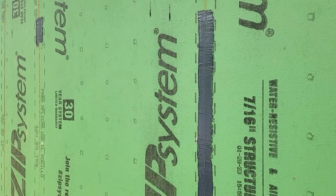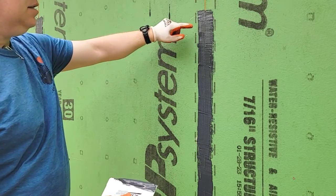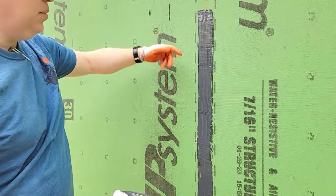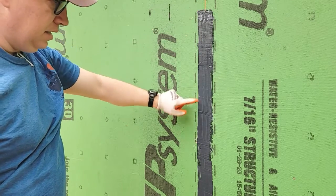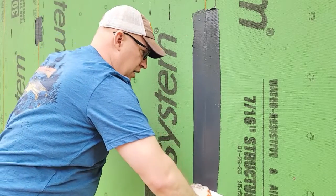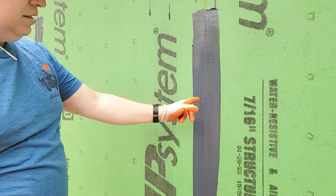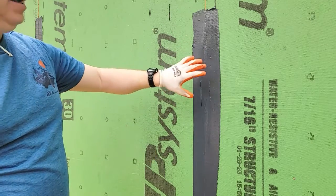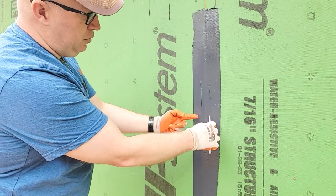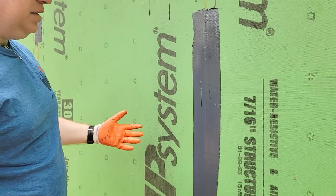One of our crew members used this applicator and said it put on a little bit too much. My recommendation is to put it on as thin as possible. You can see towards the top where we just have a few beads — put it on very thin. This amount here is a little too thick. You can see how far it's going to spread out — that's way too much. Really you need only one inch on either side, so we're wasting an extra inch on either side by applying too much. Put it on sparingly, spread it out, and really all you need is about two inches wide total — you've got the crack sealed and just a little bit of membrane on both sides in case there's movement in the ZIP system. That's all you need.